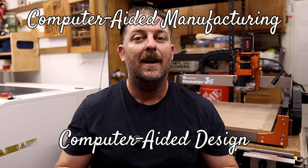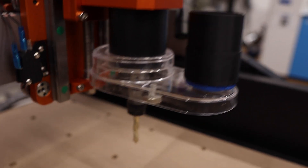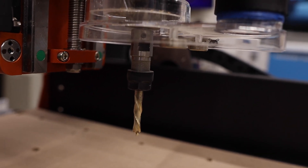If anyone's interested in more of the CAD and CAM side of CNCs, let me know in the comments and I'll make some more videos which go into more detail. I think this project will put this CNC to the test, especially because I want to use the included 400 watt spindle. To speed things up and to push the machine even harder, I want to use a quarter inch end mill. To make that happen, I installed an ER11 collet into the spindle, which will allow me to fit a quarter inch tool. This doesn't come with the CNC, but they're cheap — like 10 bucks on Amazon. A quarter inch end mill will push the spindle hard, but I think it can handle it — I guess we'll find out.